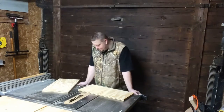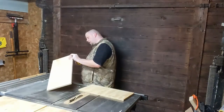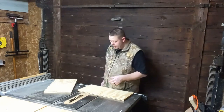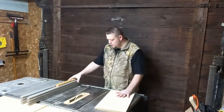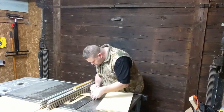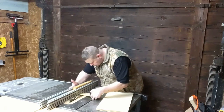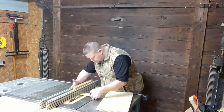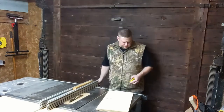I saw a video and it's supposed to work. What we're going to do now is we need these ones to be exactly an inch and three-quarters, because our plywood is a little less than three-quarters. So a little under an inch and three-quarters wide so that way it's just about an inch off of our cutting board. Realistically if it's not exact — we're talking about the alignment of a juice groove — an eighth of an inch, nobody's ever going to notice that. Let's go ahead and get these batched out quick.